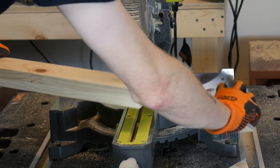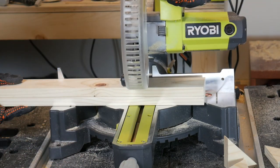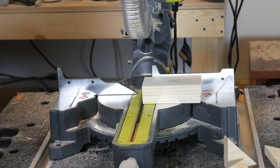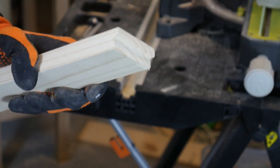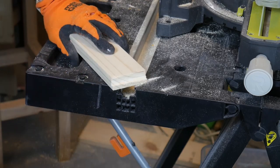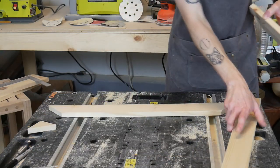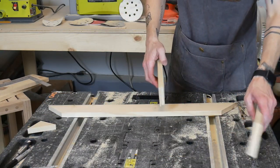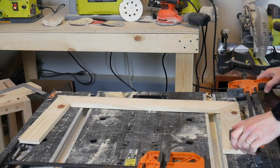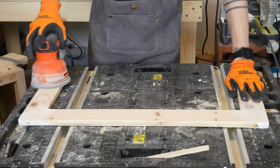Once all my trim was attached and the plexiglass was secure, it was time to move onto the lid. I was actually surprised at how long it took me to make the lid — this was definitely the longest and most involved part of the project. I cut out small notches on the front of the lid so it can sit flush on top of the plexiglass and filed them smooth. Then I used my miter saw to cut 45 degree angles for the corners of the lid. Once all my pieces were cut, I was ready to start attaching them. I used screws and wood glue to make sure that it was extra secure. Then it was on to sanding.